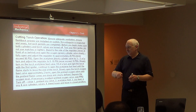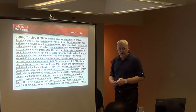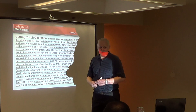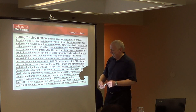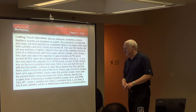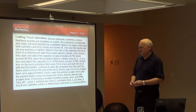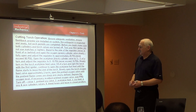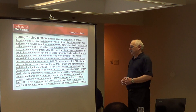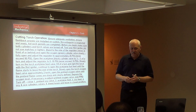Slowly turn the valves on on your torch about a quarter of a turn or so, and light the torch with your flint lighter — the only thing you ever use on it. Then open your feed valves slowly, your preheater if you're burning with it. Make sure you get a nice sharp V and a nice defined neutral flame.